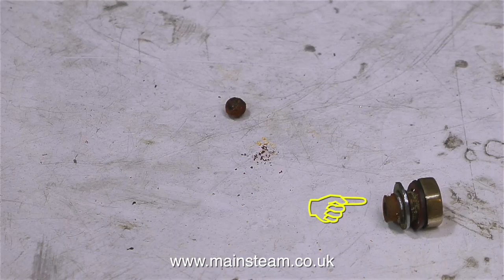As an educated guess, I would think that someone has removed this top cap in the past and lost the ball, then replaced the ball with a standard ball bearing. That was larger than the original stainless steel ball, hence the extra washer on the top cap, to allow the ball to lift off the seat — but now it's completely rusty and useless.